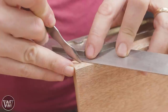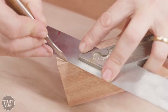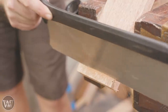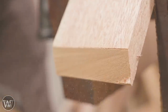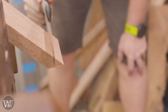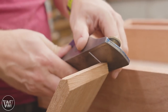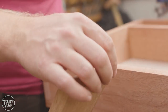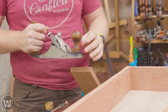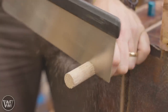Back to those triangular pieces. Now that we have them approximately the right size, we're going to put them into the corners and line them up. Originally I was going to have the corners touching at the bottoms with two 45s coming together at the top, but after looking at it I realized my measurements were off and I need to flip them around the other way — have those 45s go into the bottom corners of the triangle instead. Once we cut them close, we come back and clean them up with a plane. It's kind of exactly the same thing as Kumiko, just on a much bigger scale.